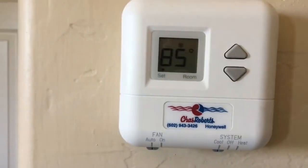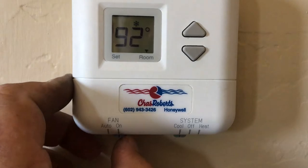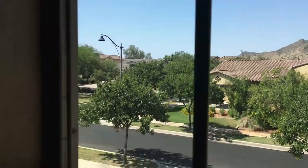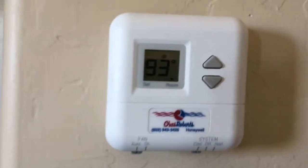Set at 89 — we're gonna go to 85, and I think it's 92 in here. This is gonna have a five-minute delay so we're gonna wait for that. I'll kick on the fan real quick. That doesn't sound good. I did test the capacitor and it's pretty low, so that might be why that thing's lagging on startup. That sounded rough. We'll wait for cooling to come on.